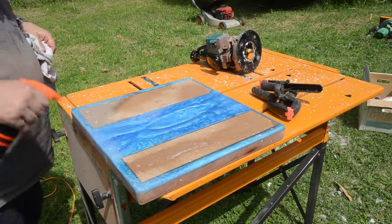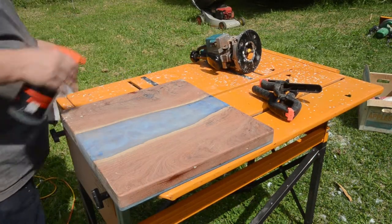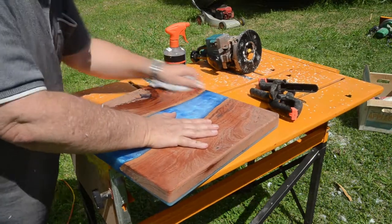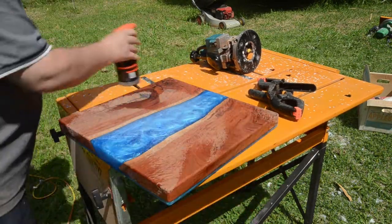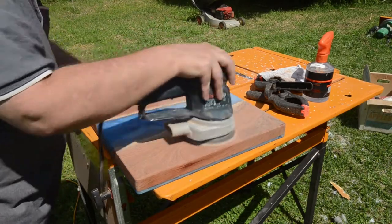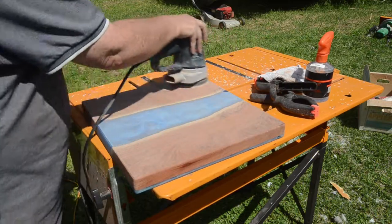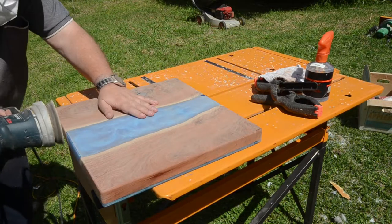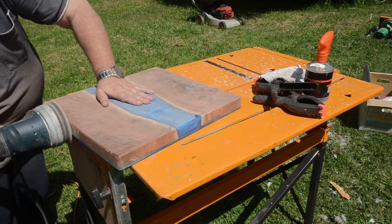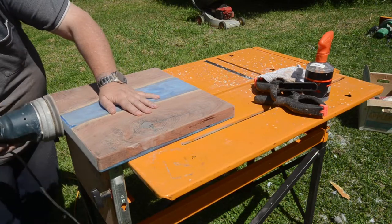Now I'm going over it with some water, wiping down any excess sawdust in preparation for the final sand. Wiping it with water just raises the grain in the timber, which means you get an extra smooth final sand — plus it looks awesome at this point. Then I'm going over it with either 180 grit or 240 grit — I can't remember exactly — but it came up so smooth. The finish I'm going to use recommends not going above about 180 grit anyway, so that's what I stuck with.